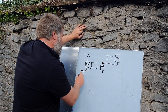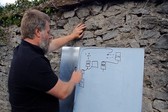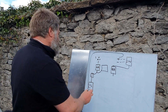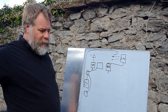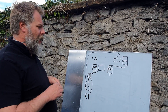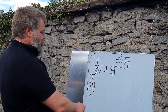Sockets that peel off from the RCD and don't go via the contactor only ever become live when you're on hookup power. One of these could be a 12-volt battery charger, so the battery charger only ever becomes active when you're plugged into a shore power connection — really useful, it just kicks in automatically. We've also got a water heater on the Vario that works on either gas or electric. We only ever want to use the electric side of the water heater when we're on a hookup connection.